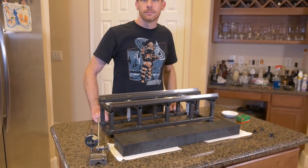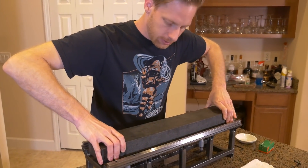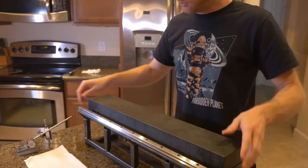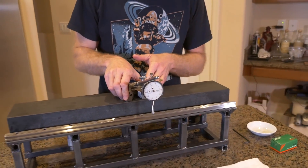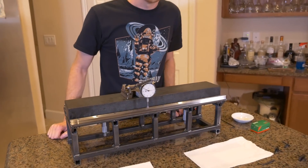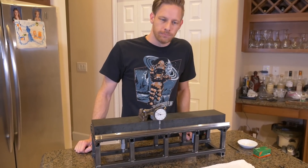We've got all the pieces — how does it work together? We take this big old piece of granite, set it on top very carefully, and then once we've leveled that using the micrometer heads, we take a little surface gauge, put it on there, and we watch to see how much it rises or falls from one section to the other. Then we can adjust by putting a little bit of shim stock under each piece to get it exactly as flat as we possibly can. So what are we shooting for in terms of flatness? I'm thinking half a thousandth — let's see if we can do it.